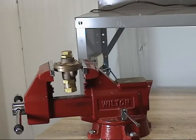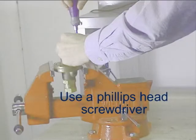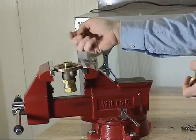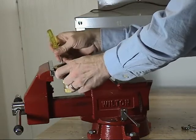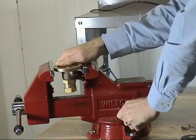To remove the diaphragm assembly, place the D2 air maintenance device in the upright position and remove the six cover screws. Separate the cover from the body and remove the spring and spring retainer. Now you can remove the diaphragm assembly from the body. With the spring, spring retainer, and diaphragm assembly removed, we can now see the Schrader core inside the body.